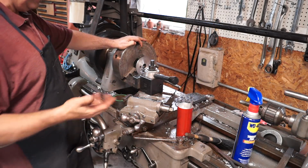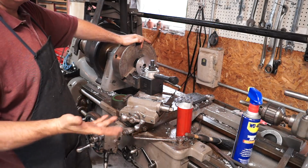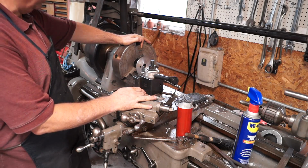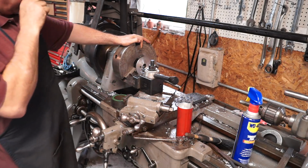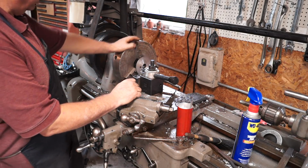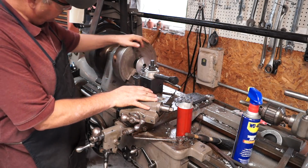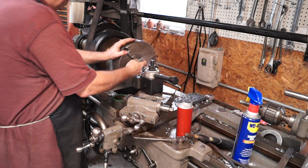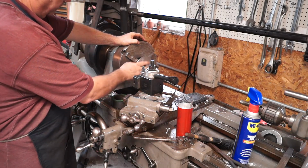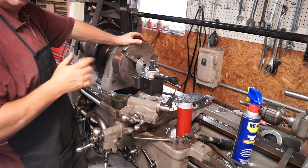So I went back to the customer and he has some steel laying around. We may have to order a piece, but we're trying not to order a piece for this little job. He gave me a saw flange, like a saw flange out of a sawmill or something, and I've already faced it off and started turning it down to diameter. Basically I'm going to get the diameter right, then flip it over and machine the back to the right thickness. Now we only need it to be like 1/8 of an inch thick, so we should be fine with this. The only issue I see with it is right here there's a hole that doesn't go all the way through, and I don't think it's going to clean up either, so we may have to come in here after I'm finished and put a spot of weld in there and then reface it, which we're going to reface into the actual part after we press it in.